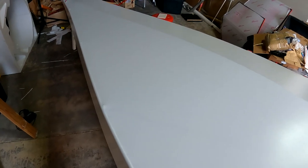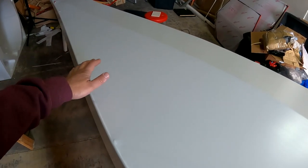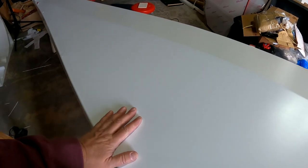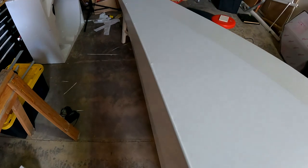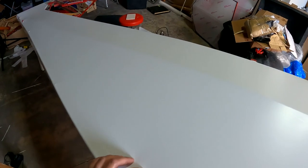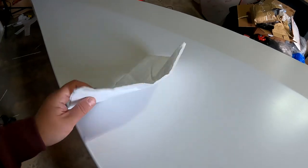This morning I looked in the 'better tips and tricks' that Lars put out to make sure I wasn't using too much heat. I had originally shrunk most of the excess out with the heat gun set at 395 degrees Fahrenheit, then came back later with the iron set at 140. The heat gun isn't super even about the way it applies, and I was worried 140 was pushing it — it's not. He says to come back at 150 to 160 degrees Celsius, and his only warning is that above 200 you can start to discolor the fabric if you don't run a double layer of white paper towel or some kind of lint-free cotton cloth.